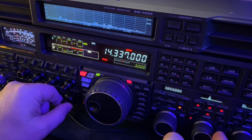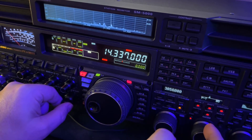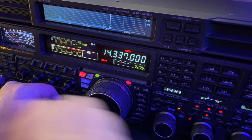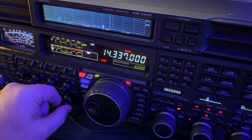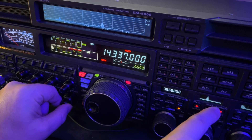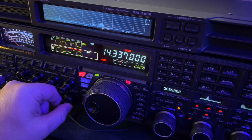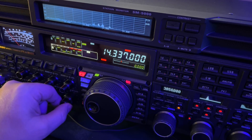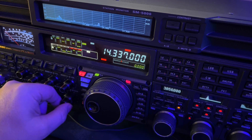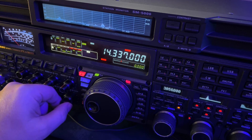The Yaesu radios allow you to do what I did: by default, the preselector comes centered up on whatever frequency you're on. But if the interference is above me, then I'm going to move the preselector to the left. That'll drop Ryan's signal down — it also knocks the noise down, which is convenient. So now all I hear is Ryan. If you look down here at this graphic, that interference station is coming from above where I put my preselector. So I can still hear Ryan, but I've knocked the interference down. You've seen me say I work my S meter to the left. Ryan's coming up to 2 or 3 now — he's really an S9. The objective is signal-to-noise ratio. I can still hear Ryan, and I've knocked out not only the noise floor but also the QRM.